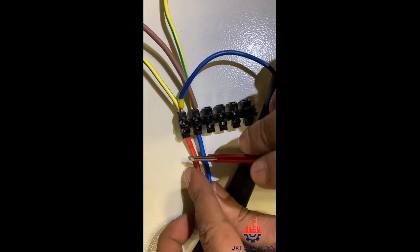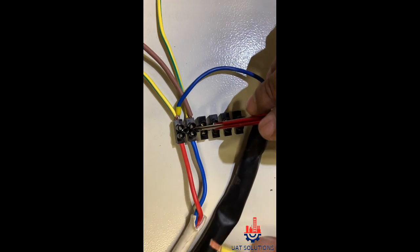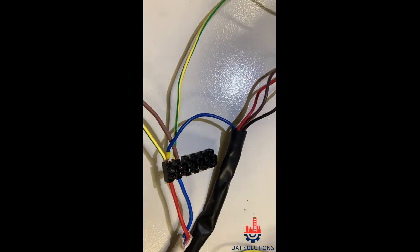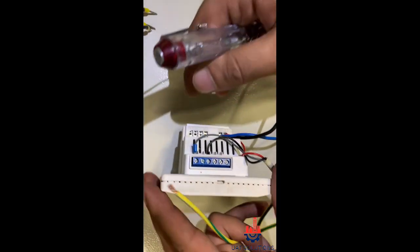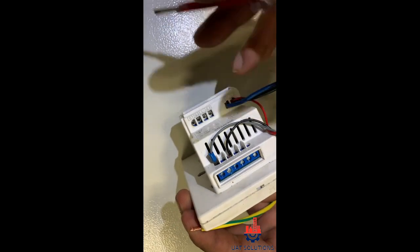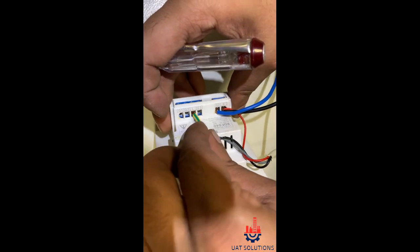The red and blue wires are the supply to the transformer input at 220V. On the input of the terminal tray, the 220V incoming power from the breaker is connected. The blue cable from the 3-speed fan motor is connected at the neutral line of the incoming power, and phase is jumped to the thermostat point L.